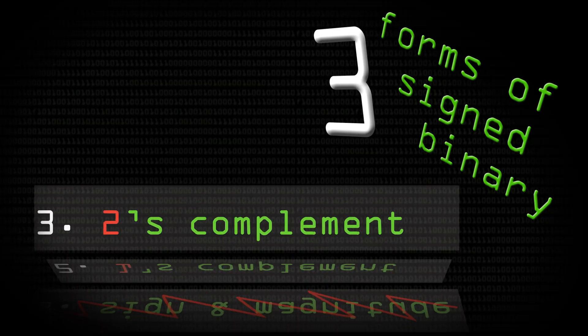Bringing around that carry bit would need a more advanced tutorial explaining exactly why, but it really does work. It simply says: treat the sign bit as normal, don't get panicked about it. If you do generate the carry bit, just bring it round to the right-hand end and add it back in. So we're making real progress now — we've got something which does give us the right answer, but you have to mess about with carry bits a little bit. Wouldn't it be nice if we could get rid of that effect, not have to worry about any carry bits, and also solve the two-zeros problem? Now there is a problem here: you've got seven positive numbers, seven negative numbers, and two left over. If you don't have two zeros and only want one zero, that 16th slot has to become either an extra positive number or an extra negative number. So we'll now do 2's complement.